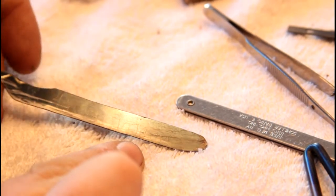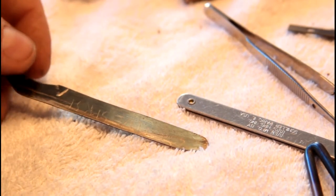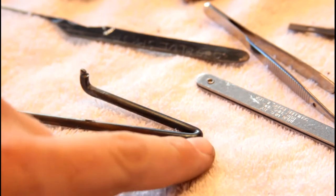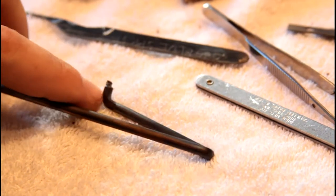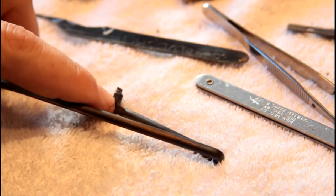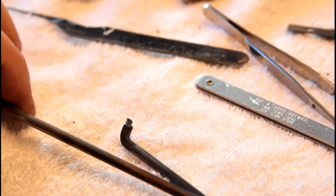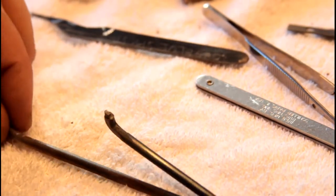If you take the tempering too far it'll be too soft, at which point you basically have to start again — fully anneal it, re-harden it, and re-temper it. It takes a little practice. That's sort of why I did that video before. With a heavier gauge wire like this you can even thin the metal by hammering on it, like a blacksmith. Annealing lets you machine it with files for precision before bringing the hardness back.